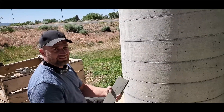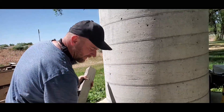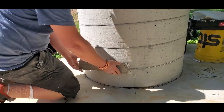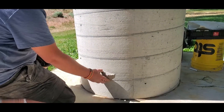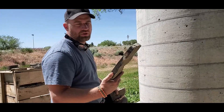This pillar is round and these stones are flat — that's what makes it kind of difficult to lay around a circle. The stone comes in all kinds of various lengths. A very long stone isn't really going to suck right up onto the pillar — a short one will do a lot better. We want various lengths, but there's a limit. We've got to cut almost every one of these long ones down to a manageable size while still trying to keep variations in the length of the stone.